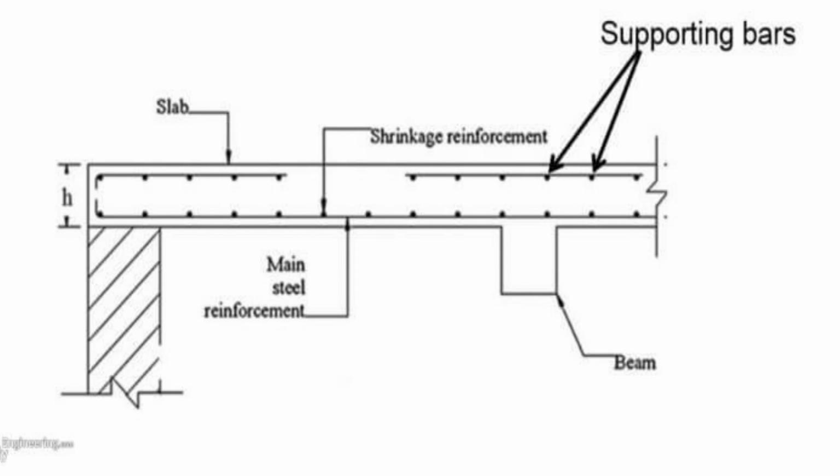The other question is, where in the slab do we put over support? I'm just going to show this little diagram here that shows that over support is only put at the edges, where a beam is, put over the beam to give extra strength and send the weight into the beam.